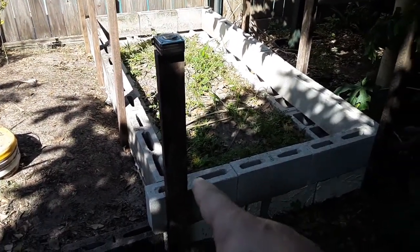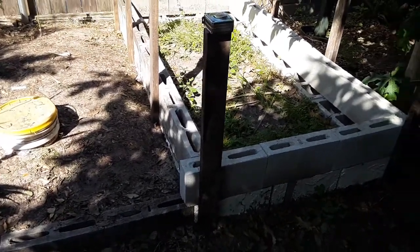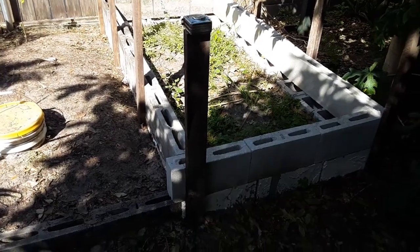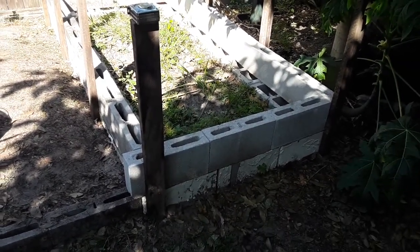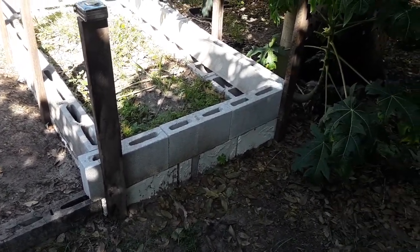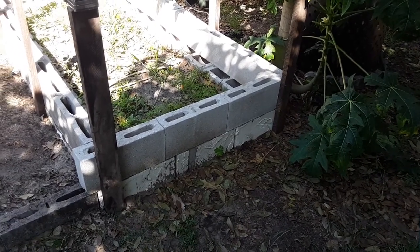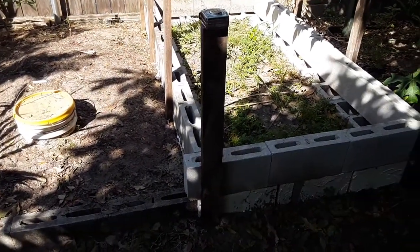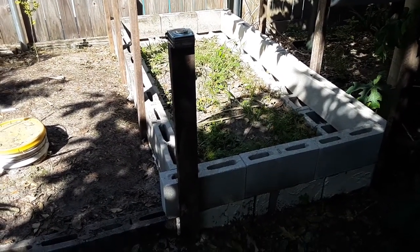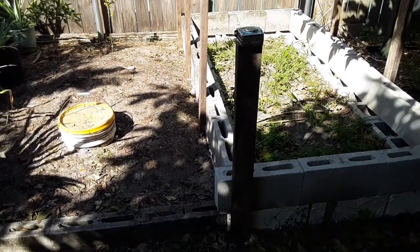I'm going to do the first row first all the way around, and then see how much wood I have left. I might end up having to use some other either plywood or pieces of 1x, since the pallet boards are less than a half inch thick, maybe like 3/8. I think I have some leftover 3/8 plywood. I can just cut them in strips, same as those boards, and then lay them down.